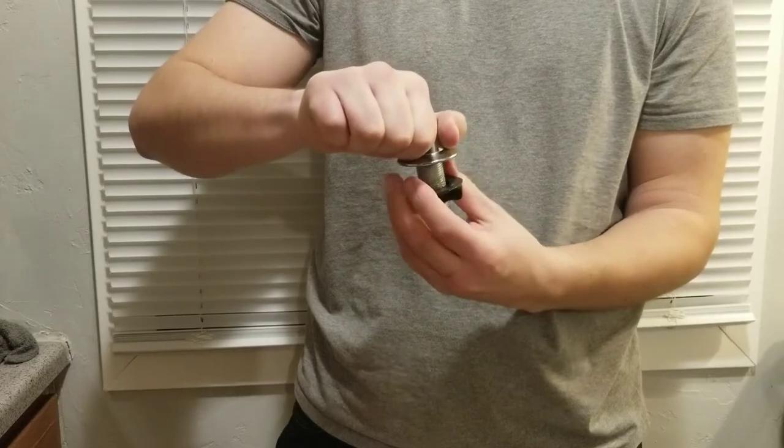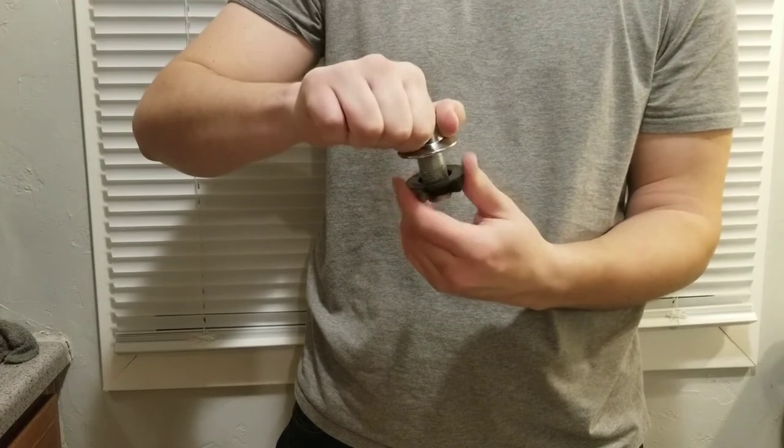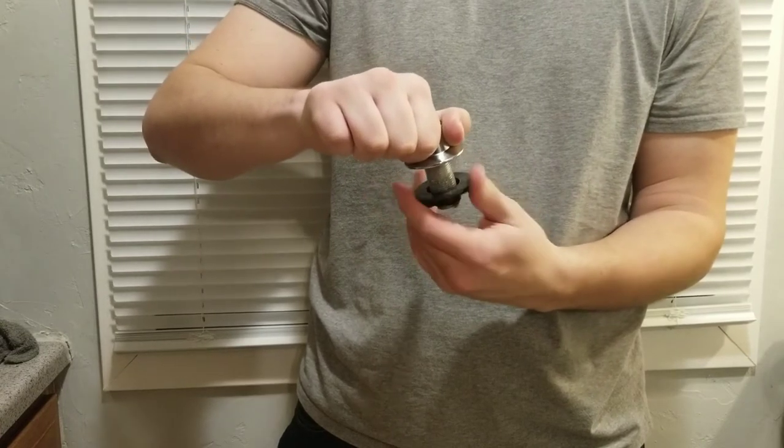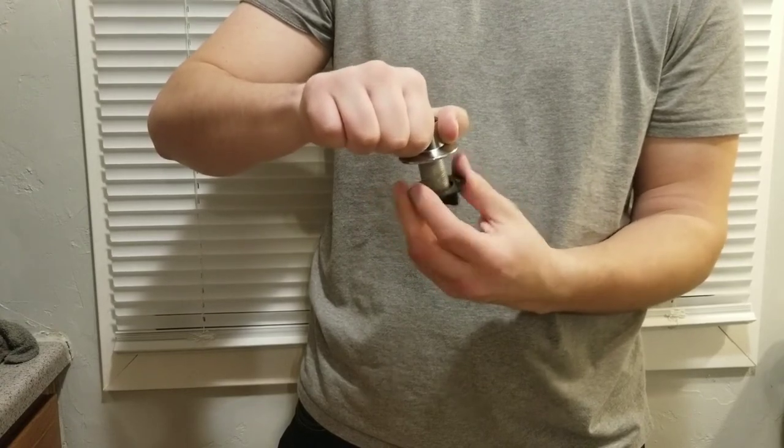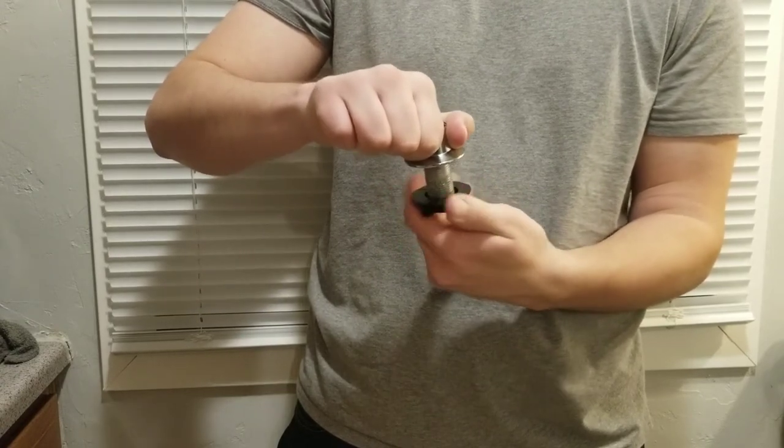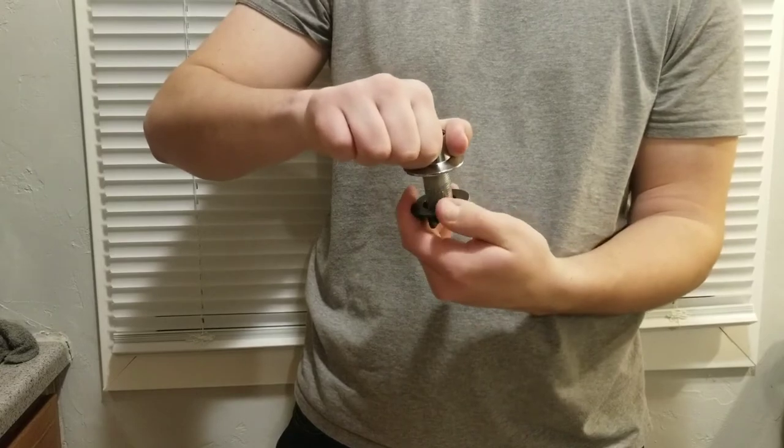Because of the difficulty recording, I just took a picture to show you what I'm going to be doing underneath the sink. In the top right, you can see that open hole where the old spray hose used to go. What you're going to do is unscrew the plastic cap underneath your sink that attaches to the spray hose assembly. In my situation it was difficult to get started, so I bought a tool that attaches to a wrench to help get it started.